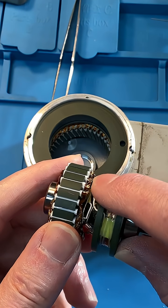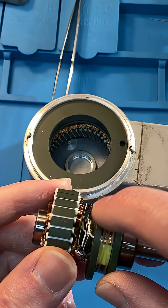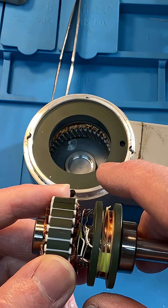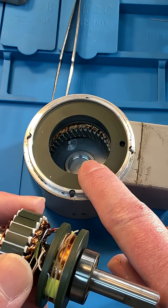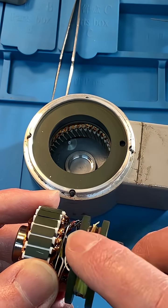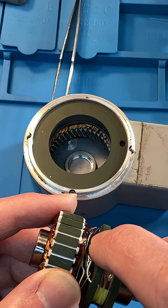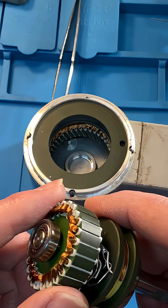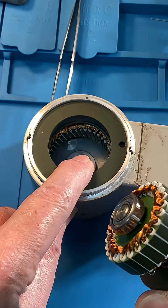There are the diodes. Now, some alternators use a primary that looks like this, and then they have an outside field which looks a lot like a DC motor field. They're excited with DC on this section — not AC — so you've got a DC stationary magnetic field with a rotating rotor with poles. That gets rectified, goes into here, and this becomes an electromagnet — a stationary magnetic field on the rotor.